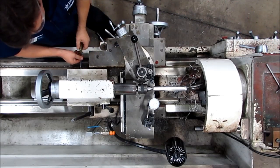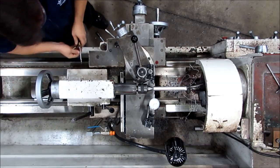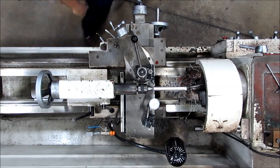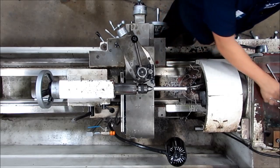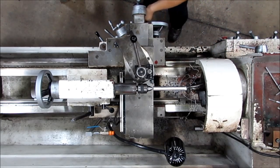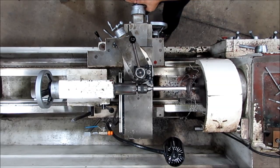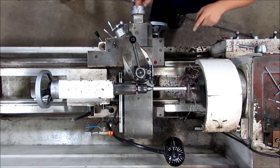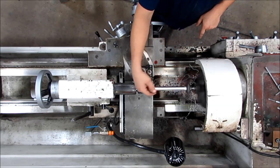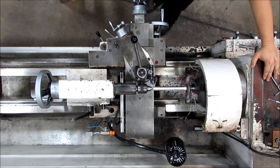Before I run it again, I'm going to go ahead and lock down the holding screws and check it again. I'm still just a little bit under six — I think I'm okay with that. I'm going to get my tool out of the way and make another pass. I'm going to come in until I touch off on it, then come in another 20 thousandths. I want to make sure I clean up the whole bar from this diameter all the way down to this diameter. I may skip ahead here.